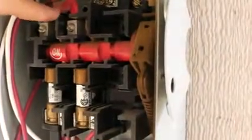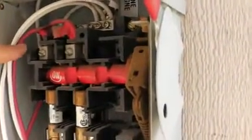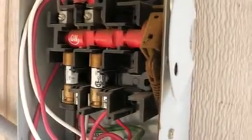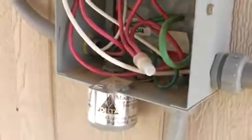Through this tangle of wires, the hot wire — the positive — actually ends up here. Two strings: the one we just looked at comes in here, and the other string comes in right here. So this is wired in parallel. You can see two fuse buses right here — that's a big fuse. The two strings are wired in parallel to each other, while the panels within each string are wired in series.